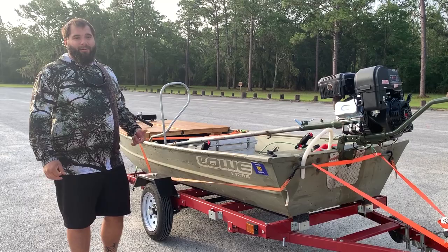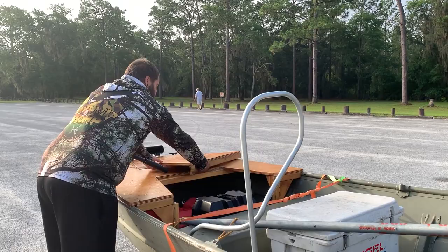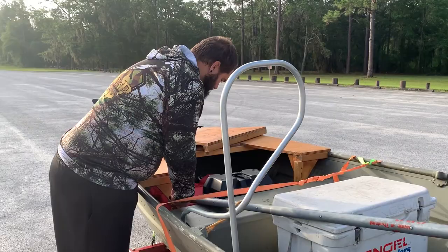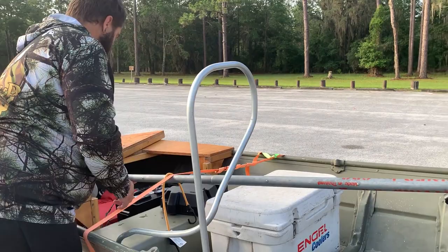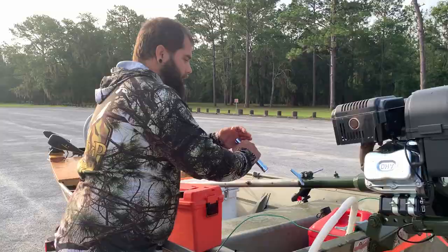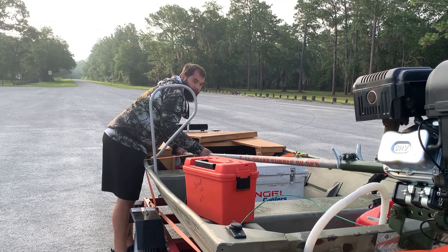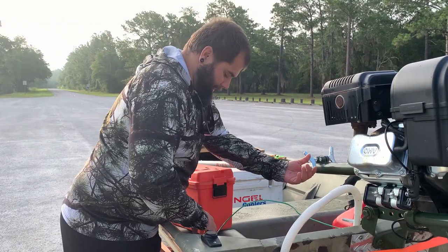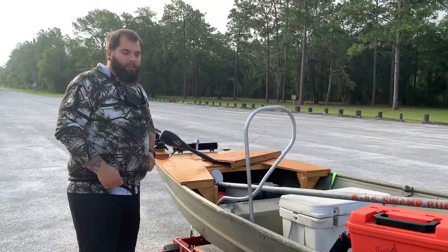So we just got to the boat ramp. I'm just going to get the boat ready to launch — come check out the way that I have this setup. What I do with the motor in order to keep the handle up high so that it goes over the tailgate is I actually twist the shaft so that it lays flat. This is obviously not upright — this is supposed to be turned 90 degrees. So you just loosen the shaft right there, simply twist it, get it lined up so it's straight up and down, and then just tighten these back down. Before I launch I'm going to take off three of the straps and leave the one on the back until the boat is in the water.